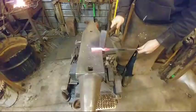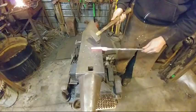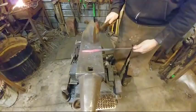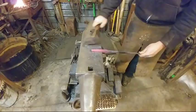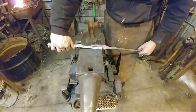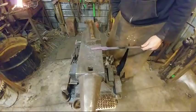At every stage during forging a pair of tongs, always go back to the immediate shoulder that you were at before. Whether you've got to be over here, whether you've got to be over here, if you did an offset, always remember that step of wherever you were at on the anvil to do whichever part. That will help you keep your tongs consistent. So, we started with 2 inches or 50 mil, and we are about an eighth inch shy of 3 inches. So we will go ahead and do one last heat on it. That will be good to go.